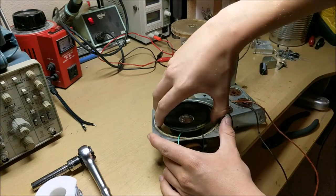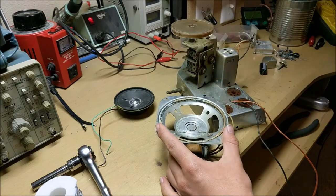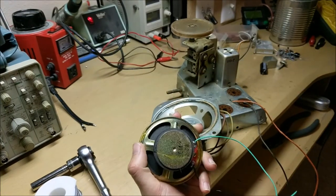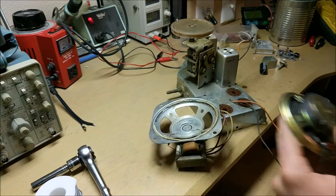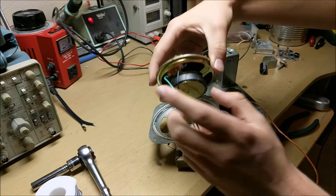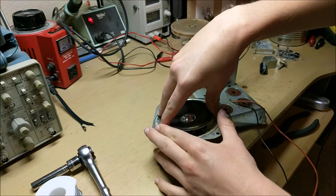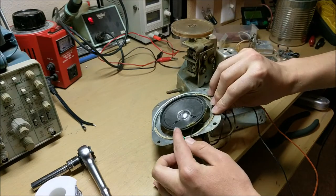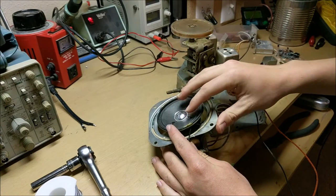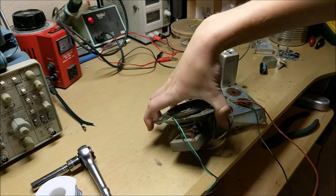Now, the old speaker had a voice coil resistance of about 4 ohms, so we need to replace it with a speaker that has a resistance of 4 ohms also. To do this, we'll just use the magnetic strength of the magnet on here to hold it to the magnet of the old speaker, and this should hold it in very nicely. I will complete this setup by soldering the terminals of this speaker to the terminals of this audio output transformer